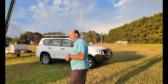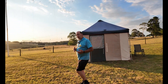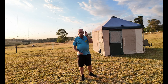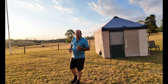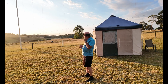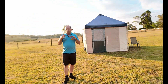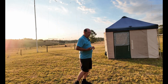I'll just walk over to the antenna — follow me. Pointing into the sun a little bit, we've got two poles that are 18 meters tall. They're plastic — PVC pipe, 90mm PVC arranged in a triangle. They're six meters long when you buy them from the plumbing suppliers and we've stacked them three high. There are pulleys at the top and the entire antenna is hoisted up from that, so when it's ready to be used it can be hoisted up, and if changes are needed we can lower the whole thing.